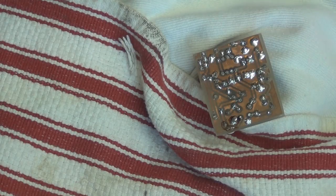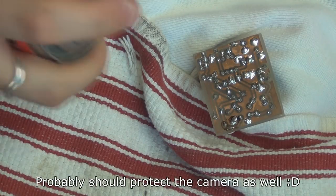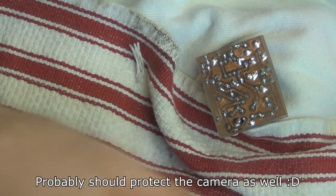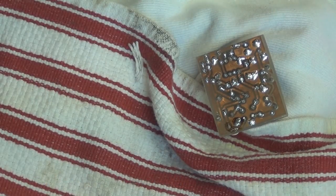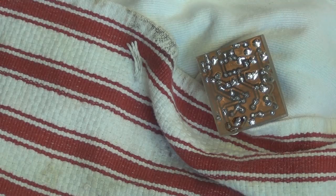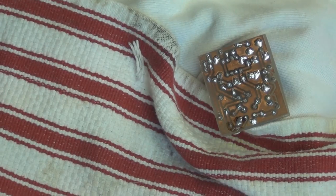The other reason why I do it is because it's just so quick — it's pretty easy, just an extra step. Sometimes I forget but usually I do it. If it wasn't inside the box I'd just flick off a bit of the extra lacquer so it dries faster. It dries pretty quick — about 15 to 20 minutes. So anyway, that's just an extra step I do when I finish the board. When the effect works and I'm putting it inside the enclosure, I just give it a quick spray and leave it for 15 minutes before putting it in. That's the protective circuit board lacquer.